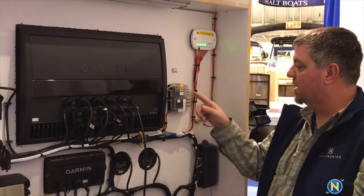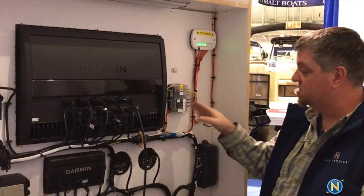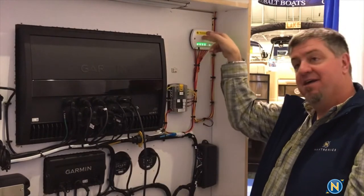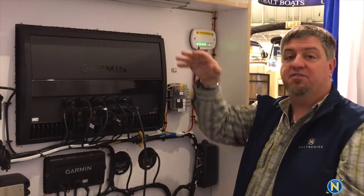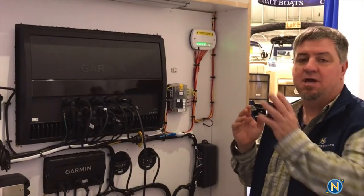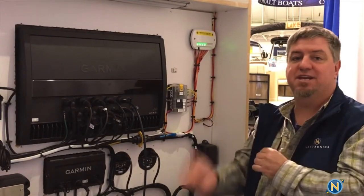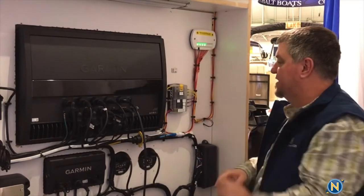What we're going to do is take our power coming in — that feeds our controller. Then we have another power source coming off of our fuse panel, and that's going to come into the Poco switch. The power source comes into the Poco switch and then out of the Poco switch into whatever LED light it's controlling. As I mentioned, it's PLI lighting — that is their lighting protocol. We're switching the color sources without needing a data wire; it's still just a positive and a negative. That's how we're controlling everything through here.